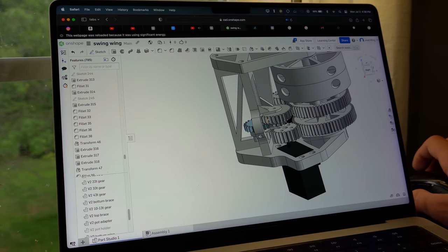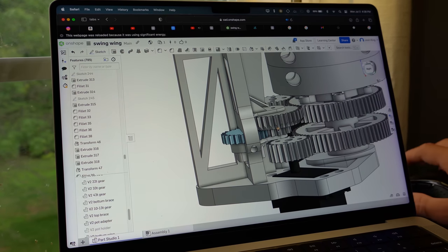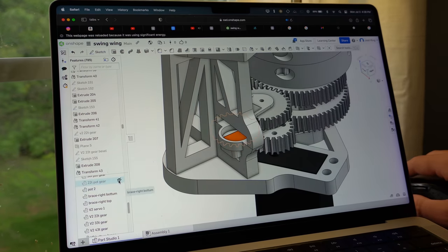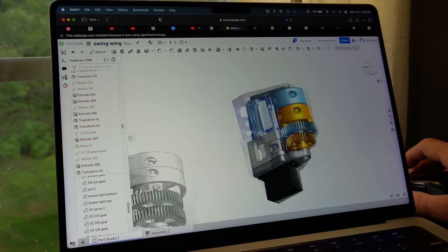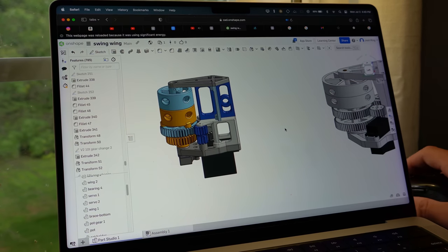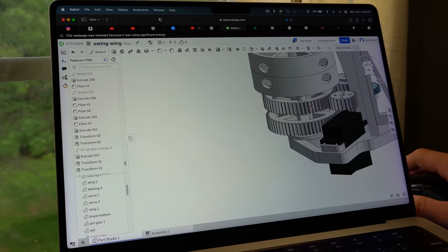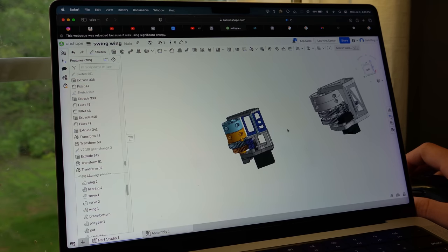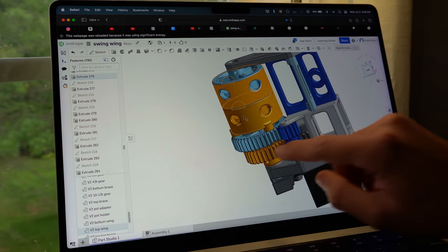With two servos, you have to have two potentiometers. And I had to come up with this crazy cool looking, by the way, gear system that made it a lot heavier that would turn the potentiometer here. So on this one, one servo, one potentiometer, much simpler, much lighter, weight reduction, baby. So you might be wondering how I was able to just use one servo unlike the two on the last one. On the last one, these servos directly drive the wings basically from these gear systems. On this one, the servo only directly drives this wing with this gear.